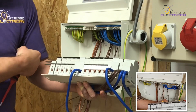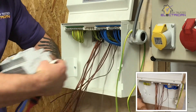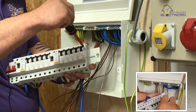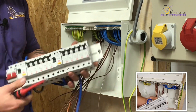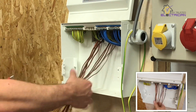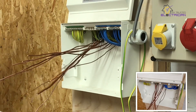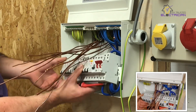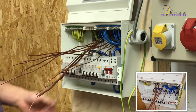I think that's far enough out. Let's flip this around — it's normally in the fusebox when I'm doing this portion up. I'm going to do up two of them and I'll do the rest in the consumer unit. As you can see, it's not as scary anymore. I've got my line conductors — the ones that have been left with labels on — I'm going to lift them up, put my gubbins back in again, and slide it under there.